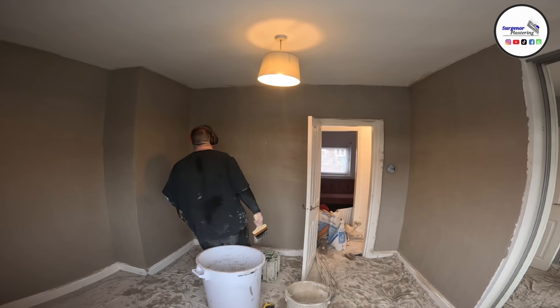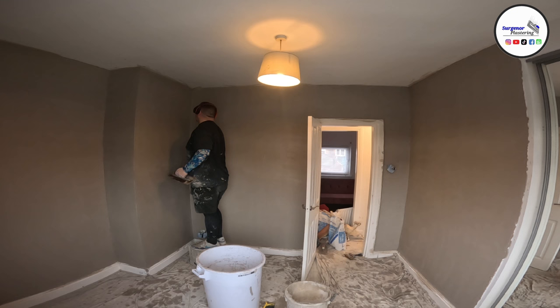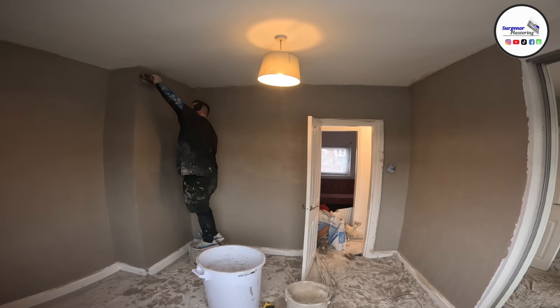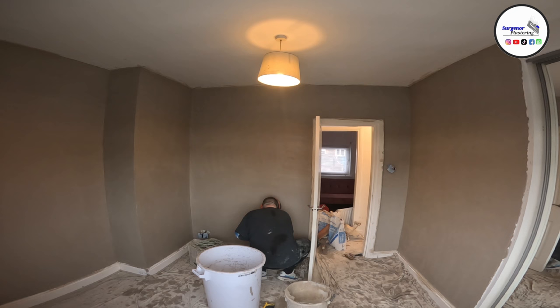In one of the next videos coming up, I explain and show you the difference between a trowel that's been completely broken and one that's factory worn. I think it'll probably be in 2 or 3 videos time. But I got this brand new, so we're cutting the plaster. We're using lots of pressure. At this stage, you can rub your fingers in the skim and it doesn't dig in, but it leaves a mark over the top.